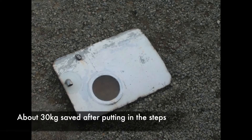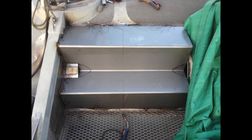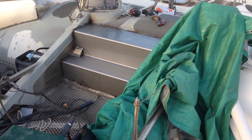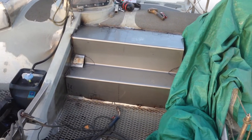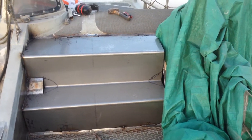I'd cut out the piece here, you can see, and welded in the steps that I'd had bent at a local engineering place, just so I'd have a nice curve for once. Because the steps I really wanted that nice tight radius, and I just would not be able to get that through my normal methods of bending stainless steel or steel plate. It's only 2mm, but it still takes quite a bit to get it right.